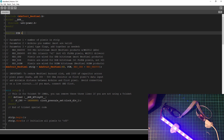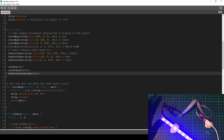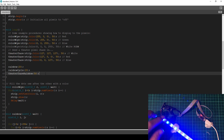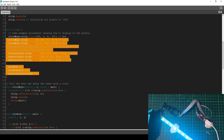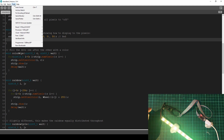After that I need to change two settings: the pin number, which is pin 0, and the number of LEDs, which is 10. To verify it actually uploads new code instead of just running what's already on there, I'm going to modify the loop to only do the color wipe in red at 50% brightness.